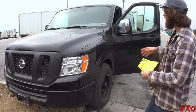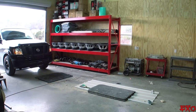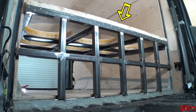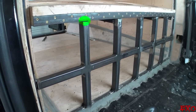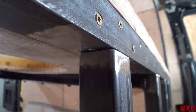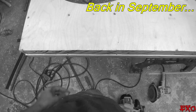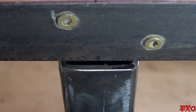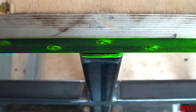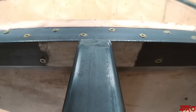Let's go ahead and drive back to the shop and resume busting through the progress on the front. Let's begin right where we left off. After attaching the baffle to the cross supports, the only spots left over are the small seams up front where the square tubes meet the angle iron — those need welding. Each piece is already cut at five and a half degrees, so they both join up pretty decent. You can also see how recessing the angle iron all those steps ago prevented the steel and screw heads from getting in the way. The front surface is nice and flat, and all the tiny cracks and countersinks will be filled up solid once the front panel gets glued into place. So let's finish those welds, movie magic style.